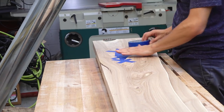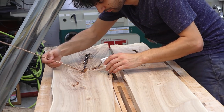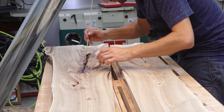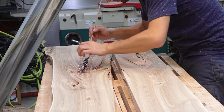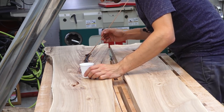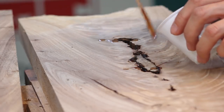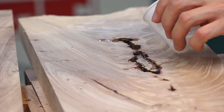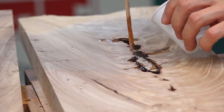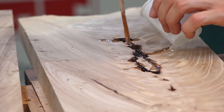The underside just gets sealed up with some masking tape. It's definitely a good idea when you have a very large void to fill in multiple steps or multiple pours. That way the first pour essentially becomes a dam so you don't have to resist as much hydraulic pressure from all that epoxy pushing up against the masking tape. If I tried to fill this all in one step, the masking tape would have to resist the force of all that epoxy above it and I'd probably end up with leaks. You can consider the first coat a true seal coat because it's literally going to seal up the openings on the bottom.